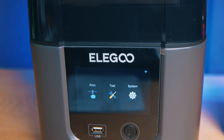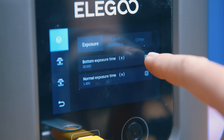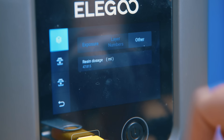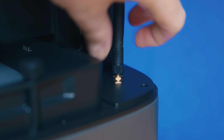This UI is not only sexier but a bit more in-depth too. The main feature is that you can edit print settings from the UI — whilst this may seem useless, try and imagine you're just dialing in a printer's exposure time. There's no need to go and re-slice it; just edit the exposure on the printer and go again. Or if you get a failed print and you know just a couple of tenths of a second exposure time would fix it, just clean the bed, change the settings, and print again. Another unique feature in the Ultra menus is Wi-Fi, which is only available on this Mars 4 model so far, and the antenna connects up inside the printer under the hood.